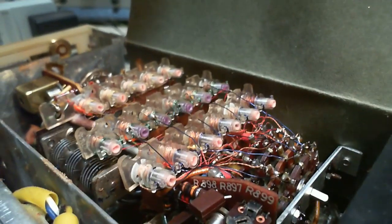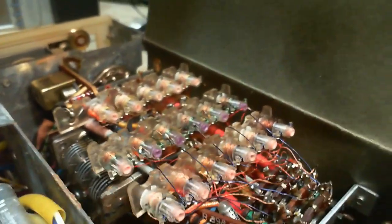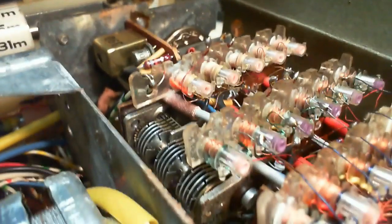Well, everything looks to be in great condition. I mean, there's a reason why this radio works as well as it does, even without doing anything. So what can I possibly do here that's going to help this guy out? Let's go back to the idea of doing all these. So what if there is a master base trimmer, and I'm not going to adjust it? Then I would be adjusting all the local oscillators for every band roughly the same amount to accommodate the error in the so-called master trimmer. The master trimmer would normally be right on the capacitor, but look at this, this is not your typical capacitor here at all. It would be easy to get to. It would be gettable. It would have to be gettable.